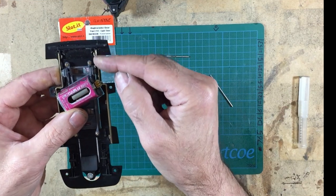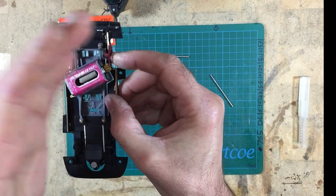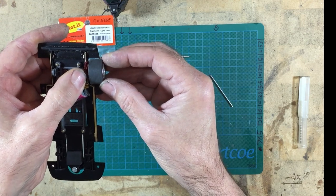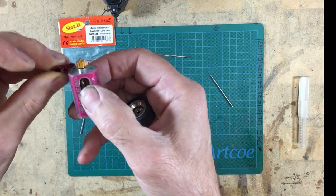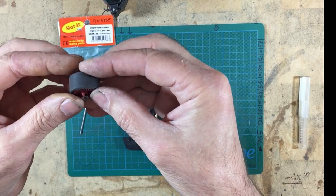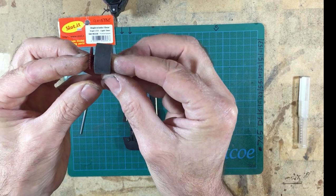This reinforcing bar here is in the way. Now, my NSR gear that I was hoping to use fits on in that orientation there because of the angle of the teeth. Now, that's a problem because my wheel would have to go onto there and it's sitting too far out on the axle for the bodywork, because I need to clear some clearance for the motor. So if it sits like that, you can see that the motor, this side of the pinion, is much further out. And when you put that into the context of the wheel, you can suddenly see that I've got big interference problems. So what I needed to do is have the gear on this side.